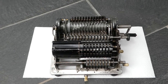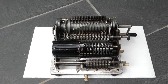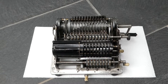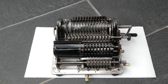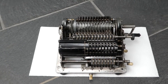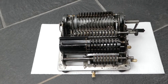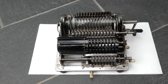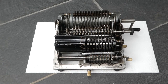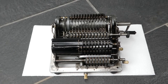This is the EOS calculator, and I have opened it up to show you the insides and how the mechanism works. It is identical to the Hanovera CK and uses an oscillating tooth segment mechanism, somewhat similar to the DEMOS but a bit more advanced, because it can do subtraction just by turning the crank in the opposite direction, just like a pinwheel calculator.